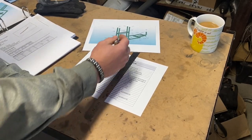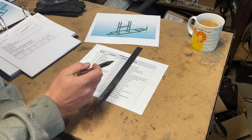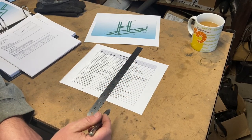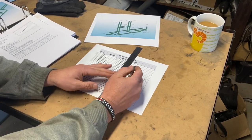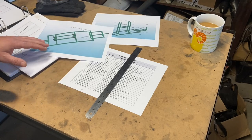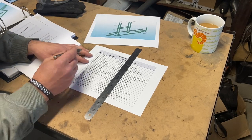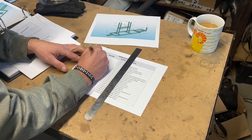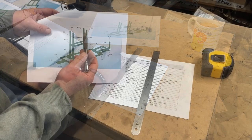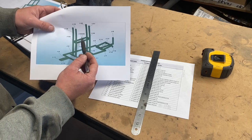Day one is just making the jig. The assembly notes are in here — it's got the part name, the part piece. The jig is all inch-and-a-half square tubing; the lengths are covered. Your notes on where to position them are right here. Remember, we're stretching this by three inches, so J1 and J2 are going to get cut three inches longer. Since we're lengthening the roof and the floor, these need to have the same extension.